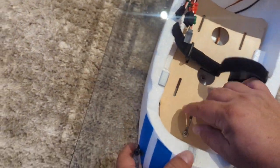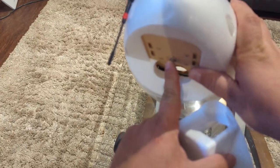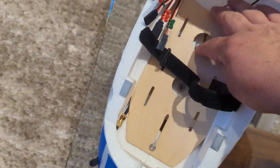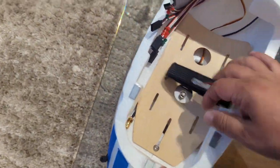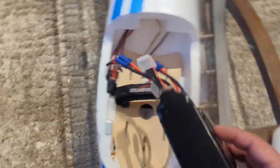There's the one screw that attaches from under the nose right in there. If you loosen that screw you can move the whole battery tray back and forth. Because of the big batteries I pushed it back as far as it would go. When the battery goes in there, I position them so the strap is just outside of the zeros — that's the right location for my CG.